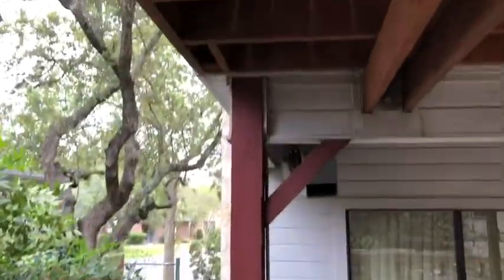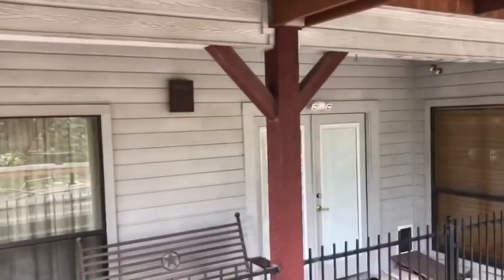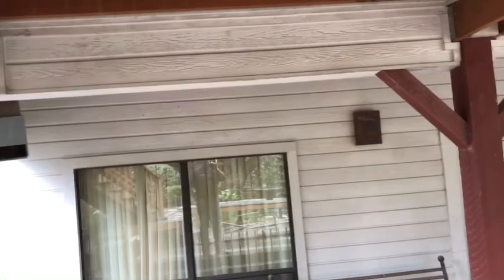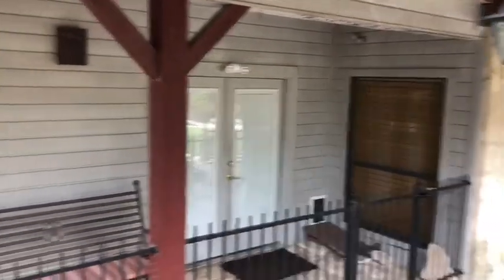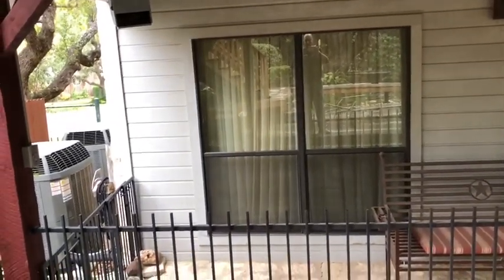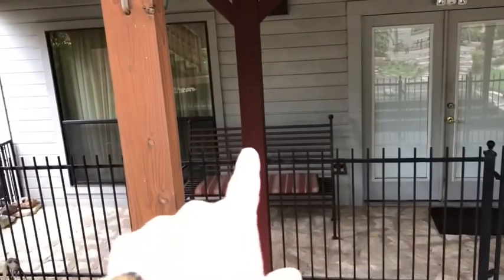That's what we got with this post here. And then underneath there, like I said, the porch ceiling and all of this facing edge below here, that's all going to be replaced with Hardie as well, and then the underneath side as well. The flip side, the opposite side of this back here, will all be replaced with the Cedar Mill Select as well. These big old windows here, the set of doors, and these big old windows here will all be retrimmed with Hardie 1x4. But again, these 4x6 posts, columns, we're not doing anything with those. So 1, 2, 3, nothing there. We're just dealing with the big old cedar 6x6s.